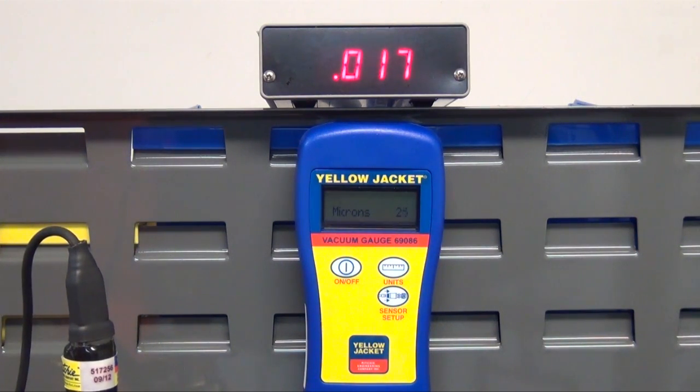I'm going to put my ball valve in the half open position. I did have a slight increase in microns and it is settling back down. We'll then go ahead and close the valve completely and watch the rate of rise. I'm doing this a lot quicker because of the video — you would let it run for a couple minutes in between. So now what we're looking for is the rate of rise. If you're getting a pretty quick increase, go ahead and repeat this step. You would open to the half position, run for a few more minutes, and close again.